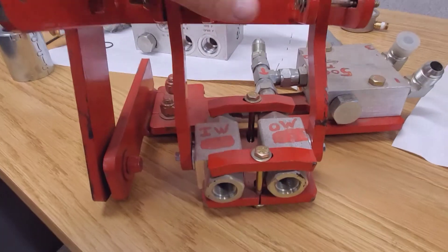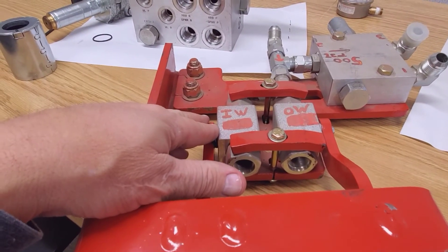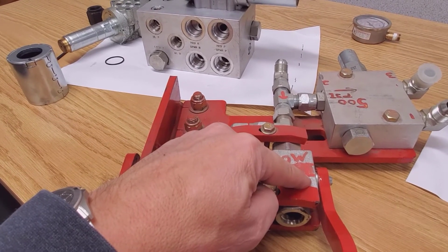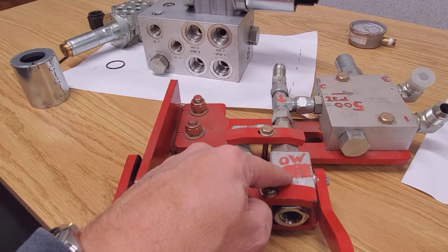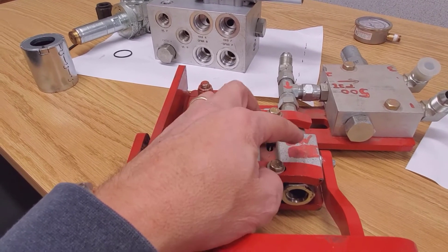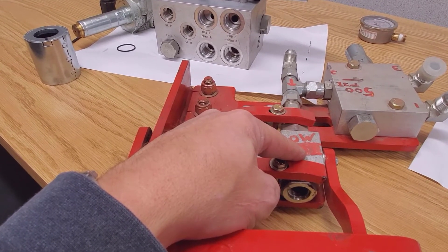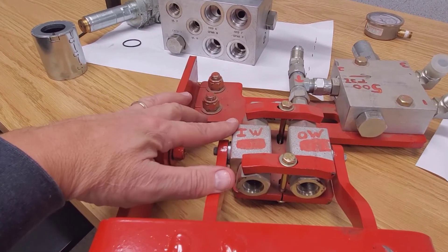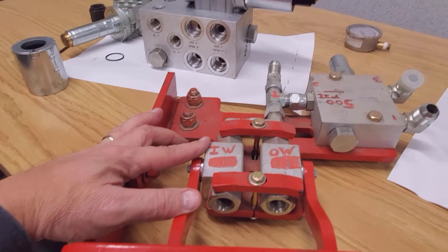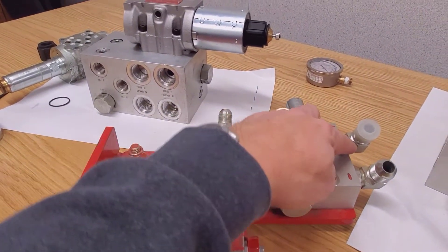When the inner wing gets to the ground, the system shuttles over: it closes the inner wing ball valve and opens up the outer wing ball valve. We then get full system pressure to the outer wing. As that outer wing cylinder extends fully, a slotted linkage allows that wing to float up and down. On the inner wing, once the ball valve closes the flow, we don't want to keep adding hydraulic pressure to it, but we do need a path for the oil. When this closes, it actually forces the oil through the pressure reduction valve.